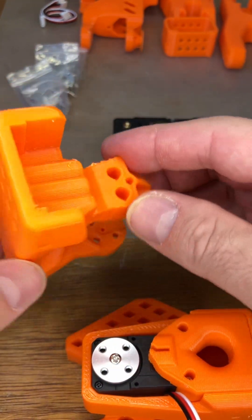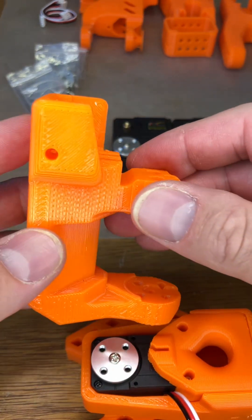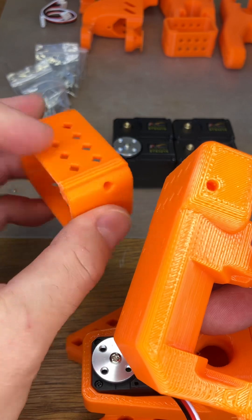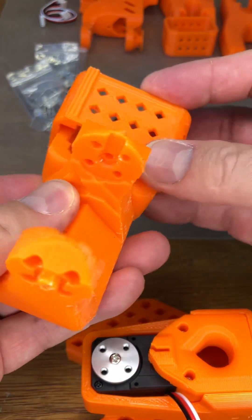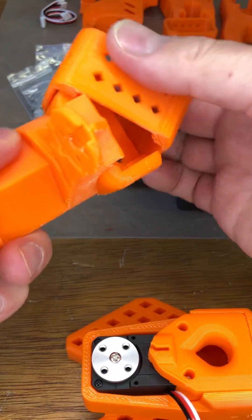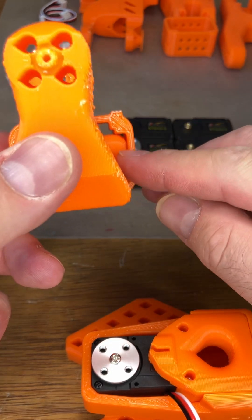This piece is called the Rotation Pitch because it has the base rotation and it also has the main pitch joint. It is also secured with a collar. The wires are marked on the collar, and when you assemble this there will be a gap if it's done correctly. If this is upside down and the wires are coming out that side, you can see there's no gap there.